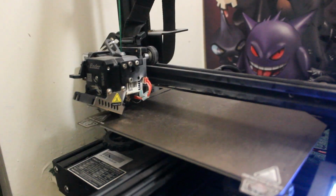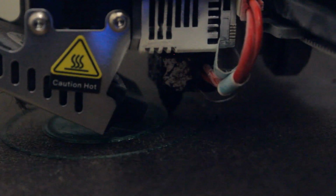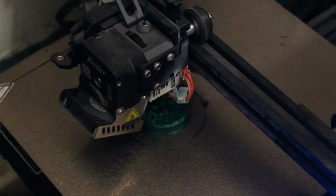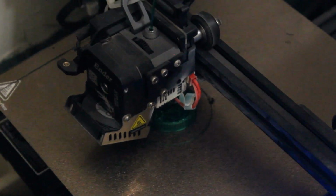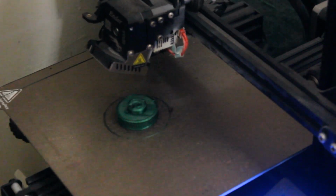So in upcoming videos, I'll show you how I connect more of this filament to print much bigger 3D prints out of recycled filament. But as of now, this print took about an hour to print, and I was happy with the way the first layer went down, which usually gives me a pretty good sign of how the rest of the print's going to go down. There was no clogging or any jam issues, thankfully to us being accurate with the cutting of the bottle and how much we were able to clean and dry the bottle in that process.